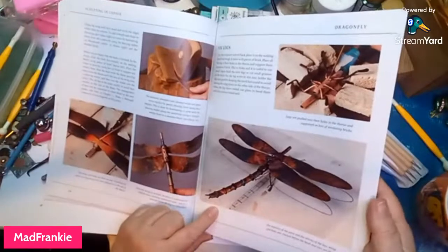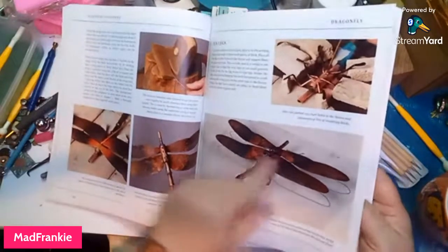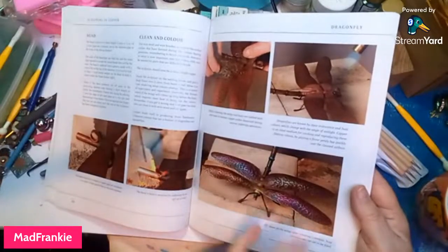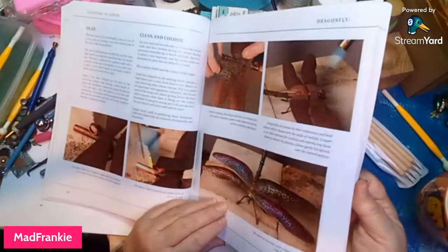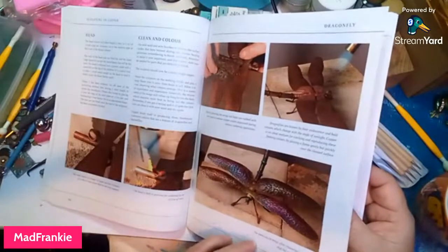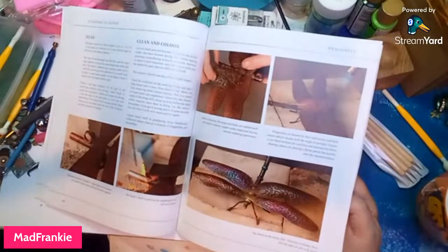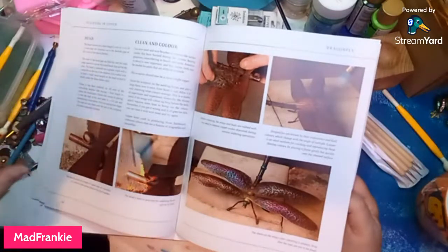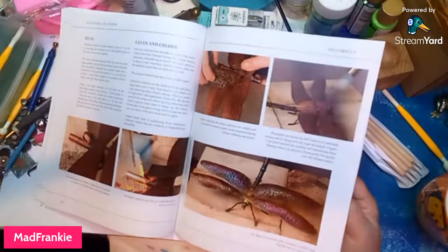I like the annealing, actually. I mean, they often go and pickle them afterwards, and then they get all cleaned up. But I'm not sure I like the cleaned up version as much as I like the one with all the heat patina on it. But I think this one is where she's cleaned it up and then put more heat patina on, so that it's nice, you know? She's using a torch. I can see the torch up. Yeah, so you clean it first, then you put the heat patina on, so you've got a nice patina. Now, that is not so easy to get to. I've had some tries with it, and sometimes you can get it. But if you then want to move on to the next piece and do the next part of one complete surface, you've got to be careful not to go back over the other bit you've done, because you can take it from beautiful purples and blues to black in quite quick succession. So you've got to be careful.